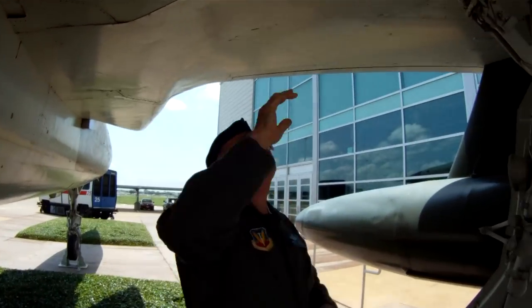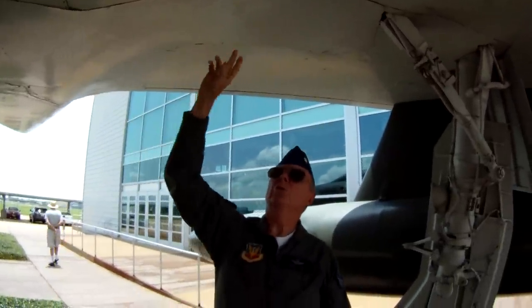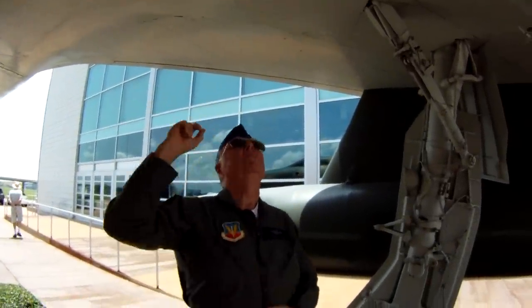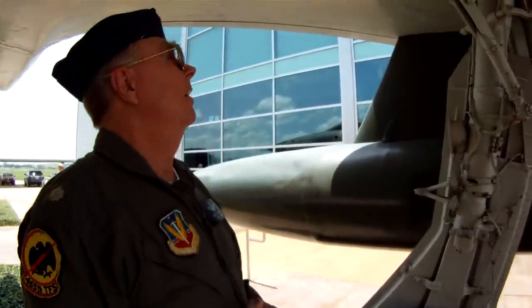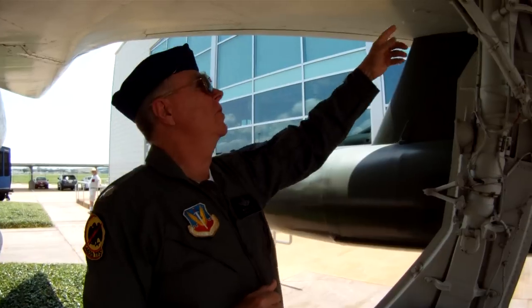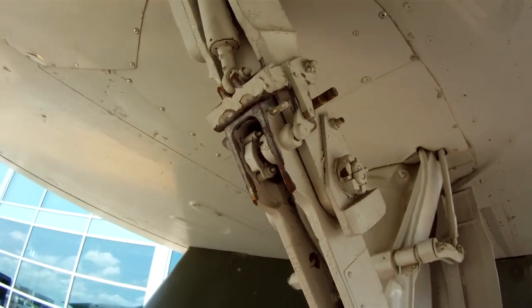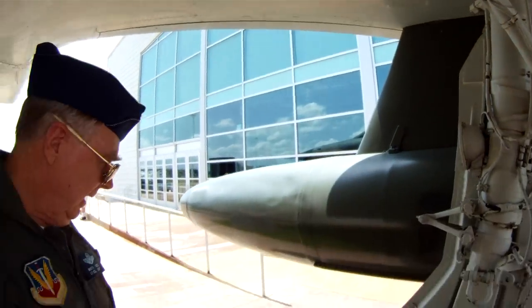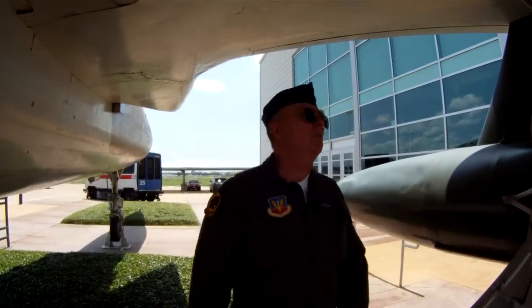Over here, normally where this plate is, you would have P1 on the left side and P2 — Primary 1 and Primary 2 — those are your two flight control systems. P1 was important because it had the STAB AUG system, the Stability Augmentation System, which took the pilot's inputs and made the airplane very easy to fly. The gear is held down by this mechanical downlock right here. The first thing that happens when you raise the gear handle is it pulls this out of the way, allowing the landing gear to come up. Once the gear is up and locked, it catches this little flipper door and pulls it up to shut it — the airplane is nice and smooth on the bottom.